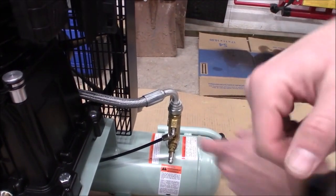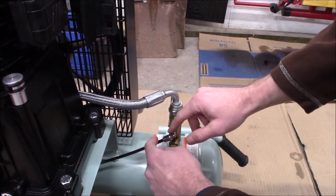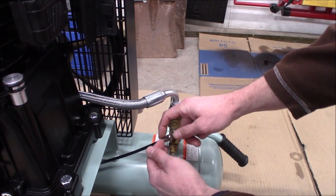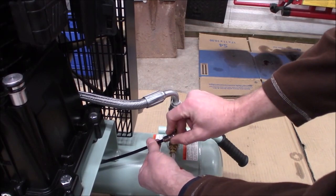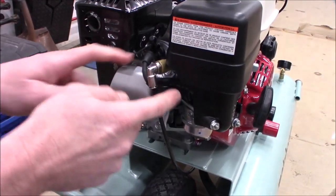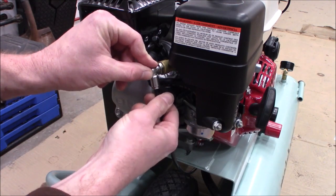The next big thing is the auto throttle regulator. This is actually pressure-operated, not vacuum. So it's pressure out of the pump that determines throttle. This tube can come a little loose — it's a push-type connector that does cage. You can actually squeeze this in much like a shark bite fitting or a fuel line fitting. Out of the box you might check this, or if there's been a lot of transport or if you're having trouble from vibration, shove that hose in all the way, then pull back on it until that lip comes out to make sure it's tight. Pressure is coming up and actually pushing your throttle lever on the engine.